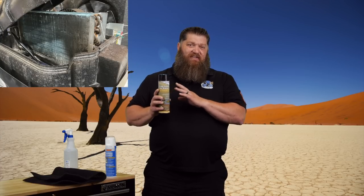Then go to the front where you have your evaporator coils. Again, there's going to be an insulated shroud — you'll take that off. For this one, I'm going to recommend a different type of evaporator coil cleaner.